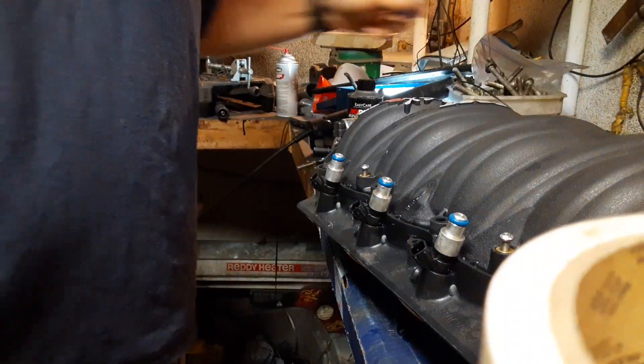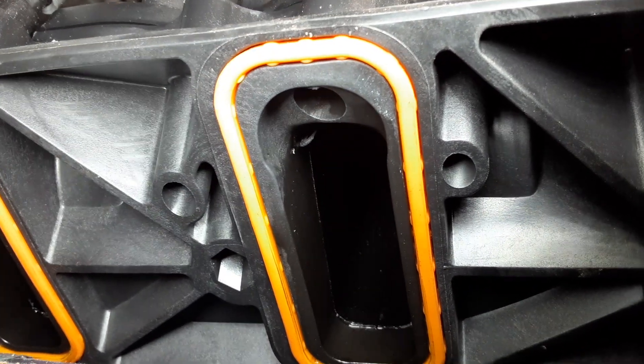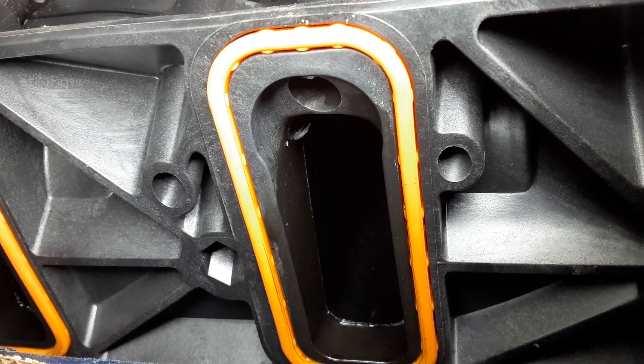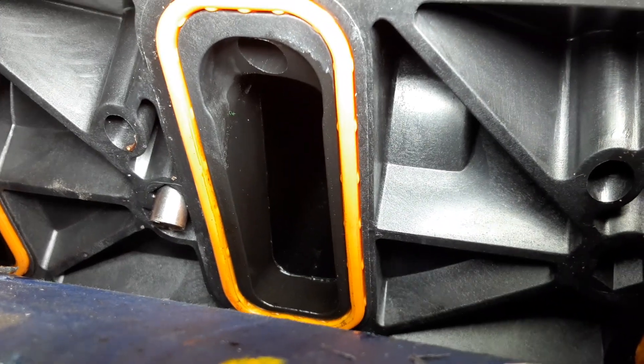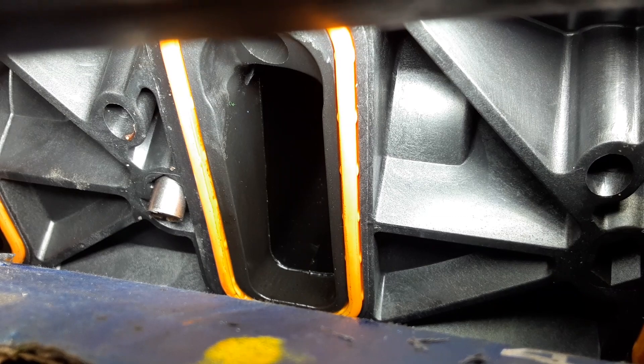And there we go, we're all the way through. Let's take a look — there's the top of our hole right now. Of course that's not tapped yet, it's not reamed or anything like that. On the inside you can see the big hole where the injector is, and right to the bottom and to the left of that hole you can see where the hole came out for the nitrous nozzle. They're nice and uniform. Using the jig like this, it comes out nice, even, and perfect every time — no need for a machine shop.